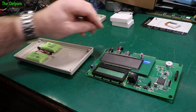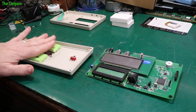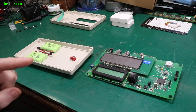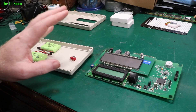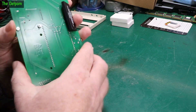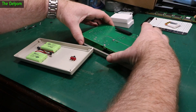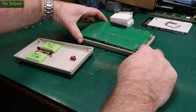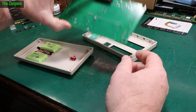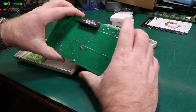What I'm going to do is mount this switch on the bottom casing — not on the top casing as normal. I'm thinking I might mount everything on the bottom casing and just have two wires running from the bottom casing to the circuit board. I could wire all that up in the bottom and tap it all onto the back of the board without cutting any traces. But because I need to add charging — charging with power off, so it can be charged without being turned on — that means I do have to cut a trace.